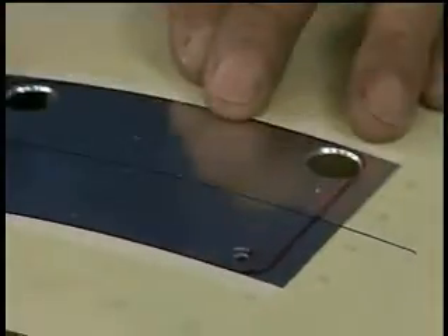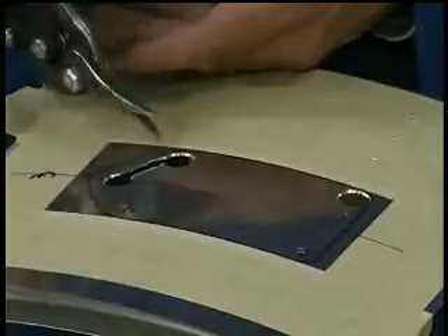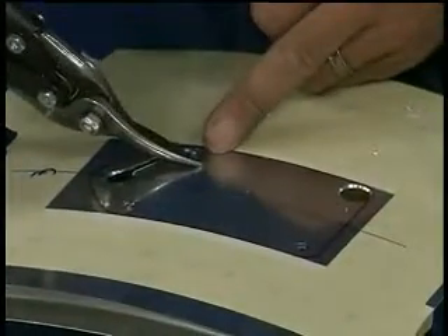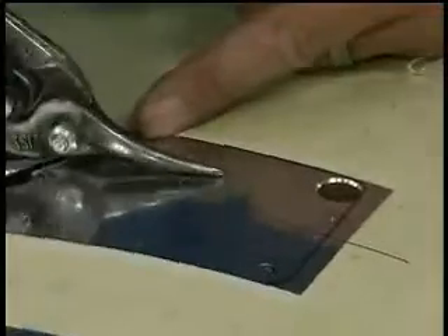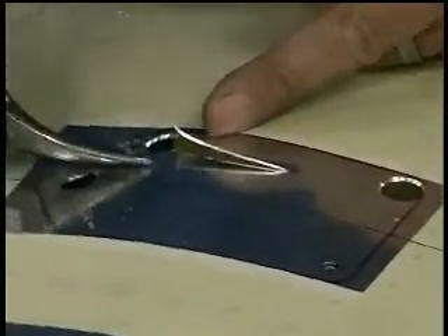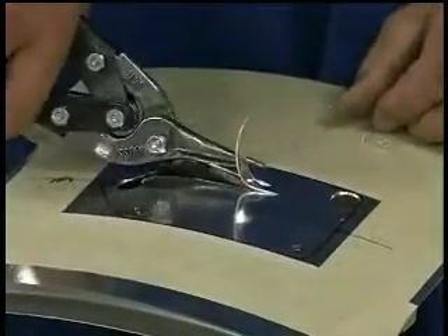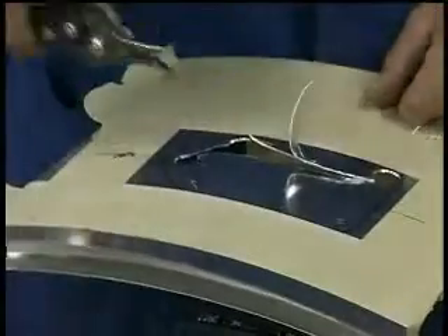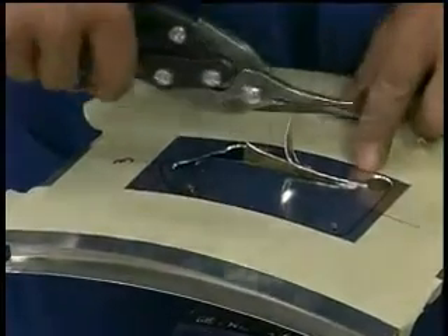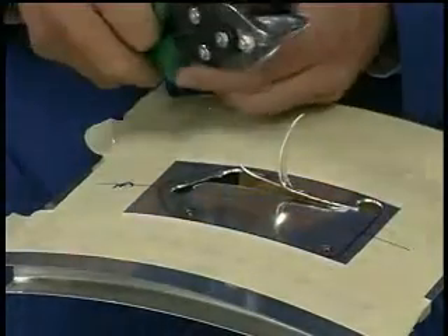Now I've got to cut from one hole to the other. I'm going to use the red or green hand shears to cut the material — once again staying a fair distance away. If it gets a little hard, start back in a second area and cut over the strip. The red shear wanted to cut to the left and had an easier time going left than right — that's why it's called a left hand cut. So I'll switch to the green one and do a right hand cut.